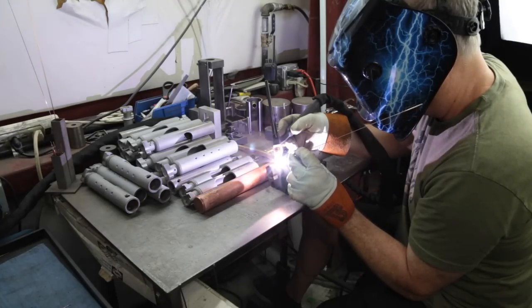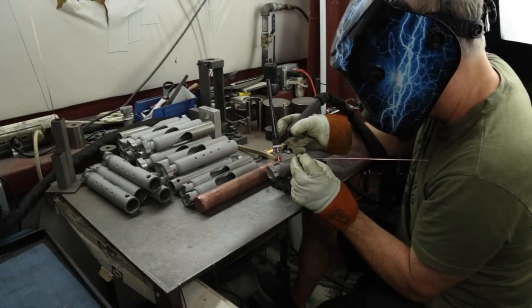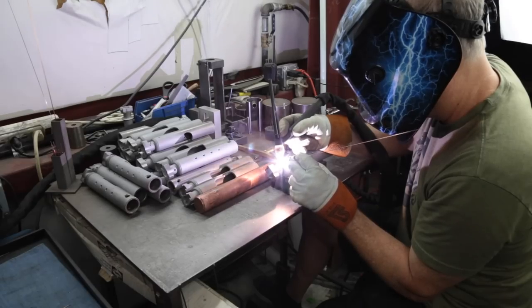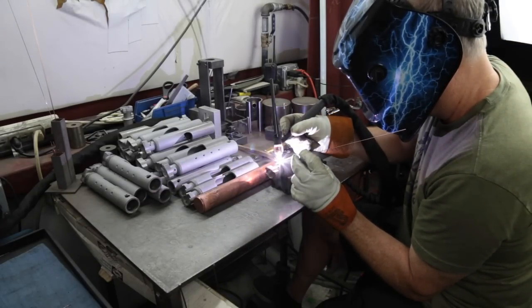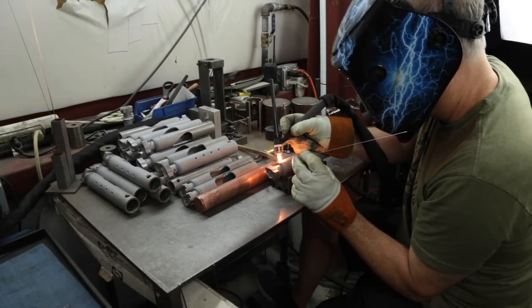Is this a big deal? Well, it can be, but in our case it's not, because these bolts go to heat treat and get hardened to a Rockwell number that we specify. There is one little issue — when we machine these things, it's really hard on the tooling. The carbide insert doesn't like going from fairly soft material to that hardened stripe back to soft material again. It's like interrupted cuts, which tungsten inserts don't like at all.